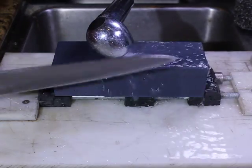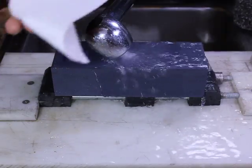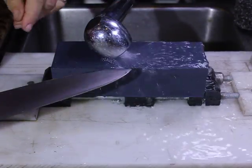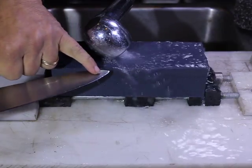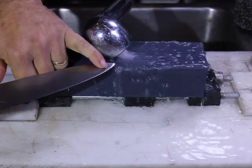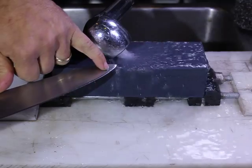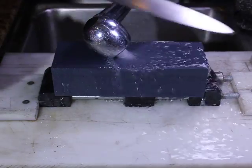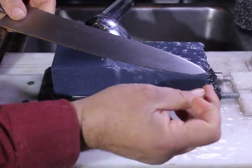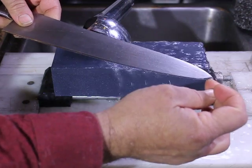So the knife that I'm going to be using right now is a customer's knife, and this knife has gone through hell. So what we see is that we have some tip damage over here, and I might add this is sort of the real world of your customers most of the time, or your friends, or people who bring you knives. So you've got some nice chipping over here, and again, using the nail test, if you can't see it, we'll take a fingernail, not the flesh part, but turn it up like this, and run your finger along there, and you'll feel where the chips are.